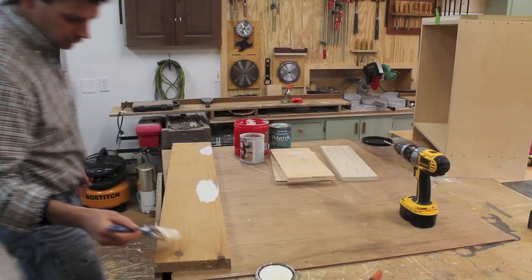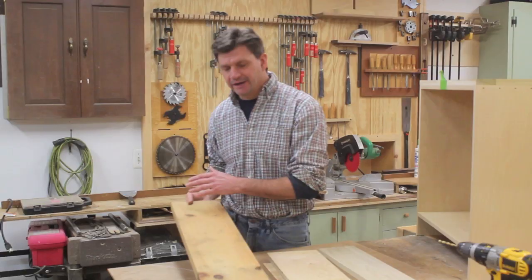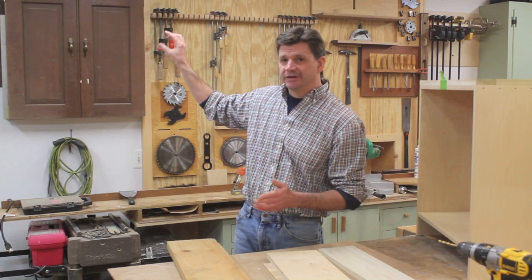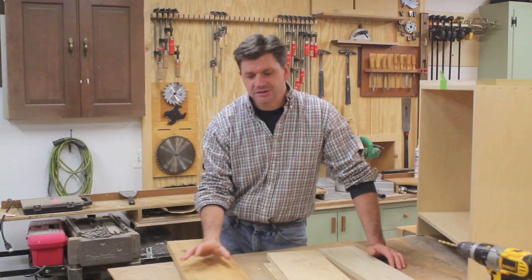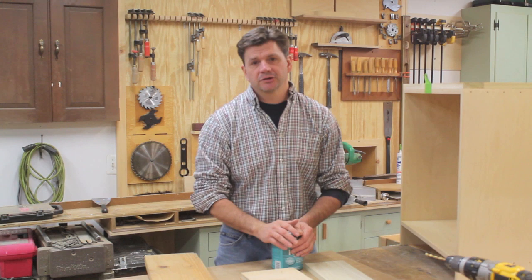If you bought a piece of painted furniture and it's made out of pine, you want to make sure that you spot prime the knots using shellac-based BIN primer — I usually use two coats. That still doesn't guarantee that the knots won't bleed through the paint, but it will help. If you've painted over trim in your home, there's a good chance the trim was pine and you'll be able to see where the knots are. That's a good reason to avoid building anything out of pine that you plan on painting.